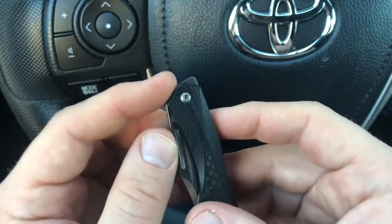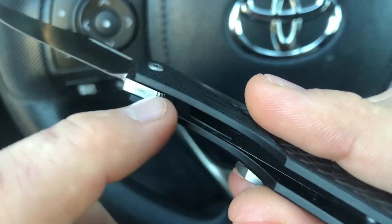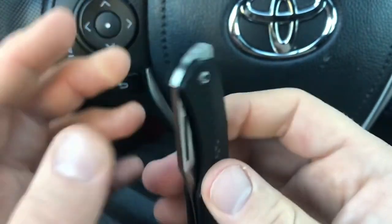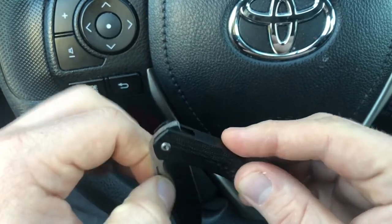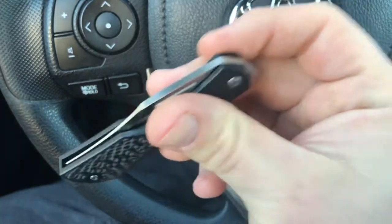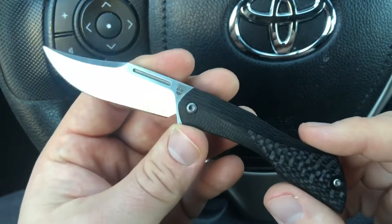This is a non-locking knife — I just pushed it closed and you can open it again. It's a detent system: there's a spring-loaded bar with a detent ball and two different detent holes on the blade. It's not an easy mechanism to get right, especially since this is a flipper. This one is really, really well done — super easy to flip open. I've shown it to people without telling them it was a detent flipper, and they've been able to flip it without much issue. It's definitely a light switch style flipper and it works really well.